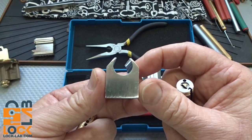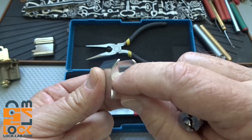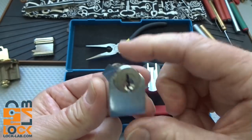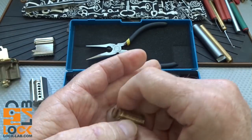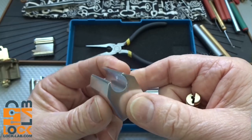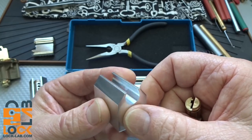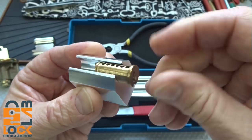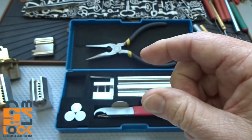Just set it down and it's not going to roll over. If you want to repin it, it's much more stable than trying to do it while it's balanced on your pinning tray. The larger one measures 0.49 inches, which is 12.45 millimeters - that's for Schlage, Kwikset, and all the standard cores. The other one is for Master and American locks, measuring 0.371 inches, which is 9.4 millimeters. An American core slides in there absolutely perfectly.